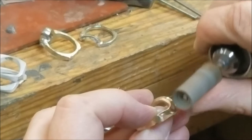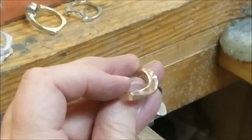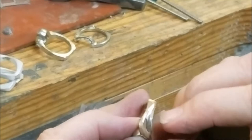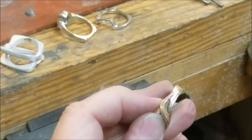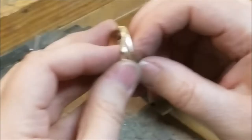I'm going to come up to the top edge — there's a pit there I want to move right through. I'm pleased with that. We're looking at the reflection of the light to find any flat spots or irregular surfacing. There are some little pits or low spots, but this is no longer the appropriate tool — there's a point where it stops working and you have to work it too hard. I would go to a rubber wheel next, because then you can match your contour perfectly.